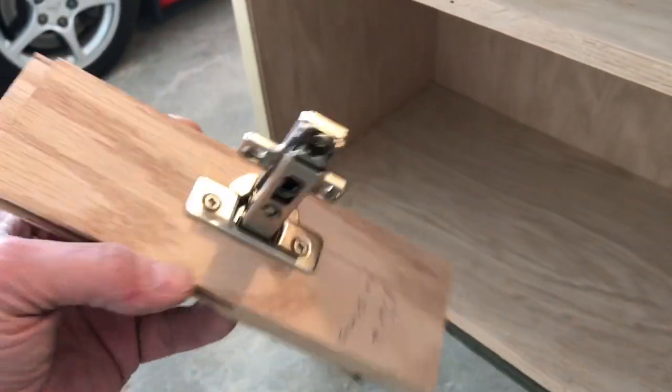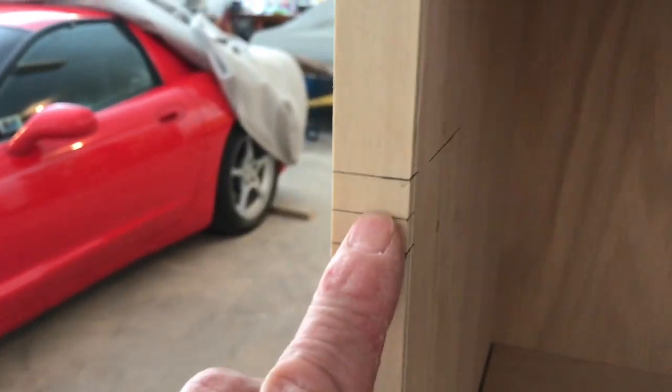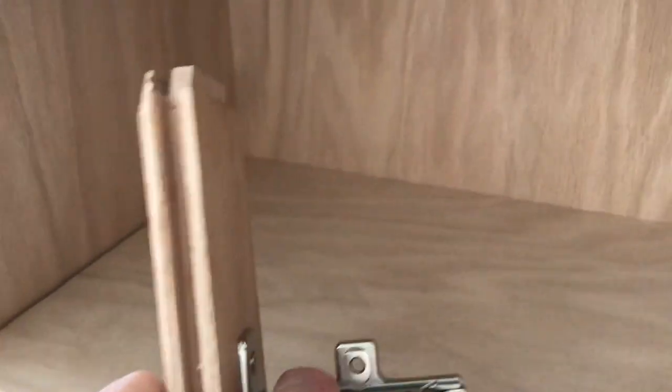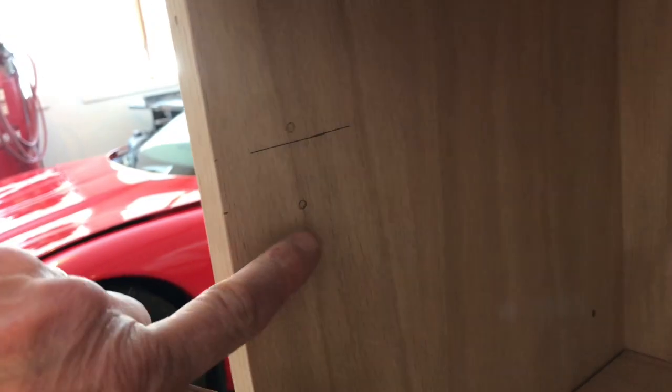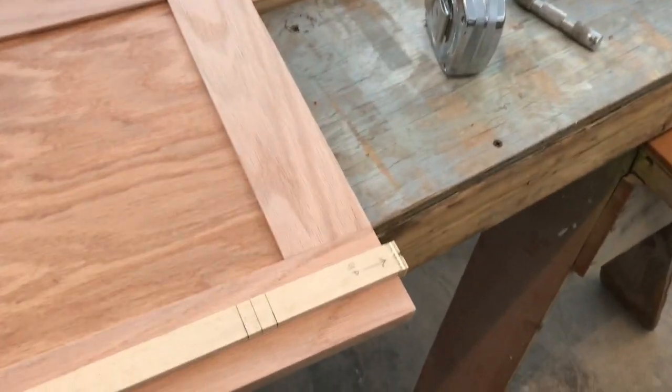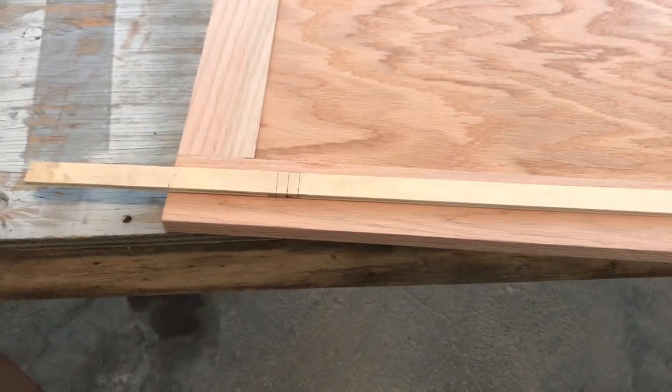I've made a little mock-up of how the hinge is going to work, and I also made a story pole here. You can hang that on the edge of your cabinet with all the layout marks on there and get everything just perfectly right. That would be dead center of the hinge; the top mark would be the top part of the hinge. What I've done is marked the top of each hinge, then I can take my mock-up, put it in there, position it, and mark the locations of the screws. I can also use my story pole to mark dead center of the 35-millimeter hole — I hook the top of the door, mark it there and there, and it should match up with what I've already marked in the cabinet.